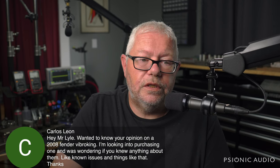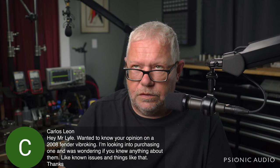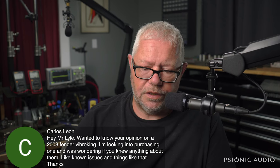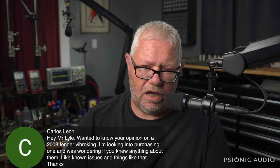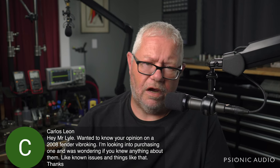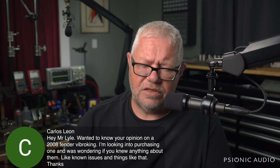Yeah, Carlos Leon, sorry. Avoid Fender Vibro-Kings. They're absolute garbage. This might be on my Facebook thing rather than the YouTube thing, but a guy brought one in, and it was just ground loop city. The entire thing is a Zinky design, and it was so bad. Big, white, heavy-duty grounds everywhere, none of which were intelligently done. Huge loops, dual gang 500K linear pots for everything, some of them wired in parallel to give different values. Just the cheapest of the cheap.